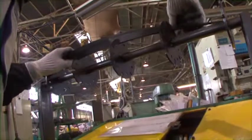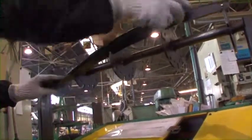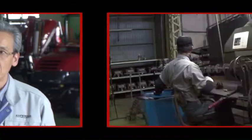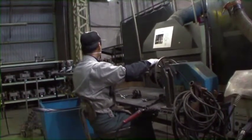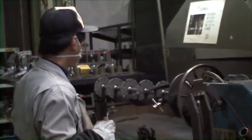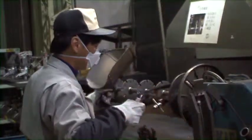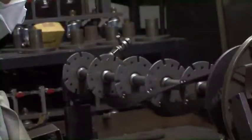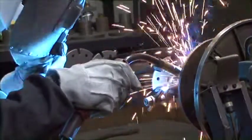We have about 15 skilled workers who specialize in reel cutter production. One of these has been working here as a reel specialist for 27 years. At this point, we begin to assemble the reel cutter. Reel blades, bent into a high-precision curve, are individually welded into a reel by a skilled worker before they are sent to the final welding. This process could be done mechanically, but Baroness chooses to have it done manually in order to assure more accurate installment.